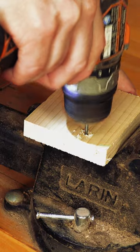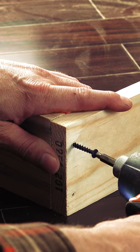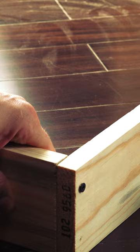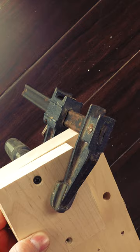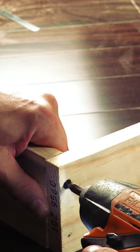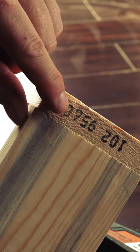That means you're left with the old-fashioned method of drilling pilot holes before screwing. There's a common problem that happens when screwing two objects together: a slight gap will oftentimes work its way between objects being joined. Clamping can solve the problem, but clamping isn't always possible. If you're screwing wood pieces together, you might be tempted to close the gap by pressing harder and squeezing the trigger, but this can damage the top layer and cause wood splits even if you drill.